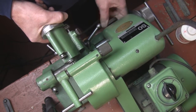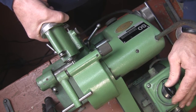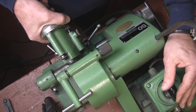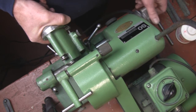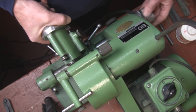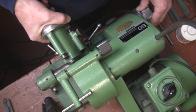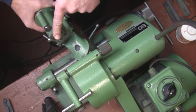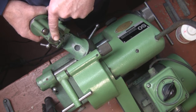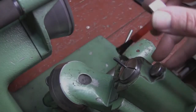We would turn on the grinding wheel — big tip here — I'm going to come in using the knob on the left and slowly bring it in until I hear it hit the wheel. It's a 3/16 cutter blank, so we need to move it in half that to split it. What we want to do is dial in 93.5 thousandths or so.